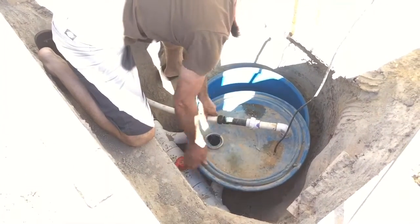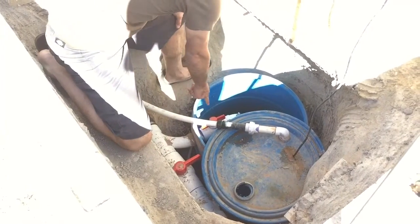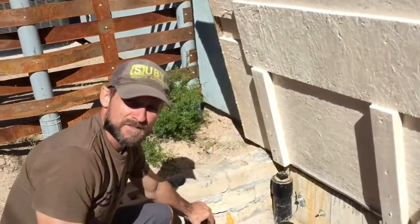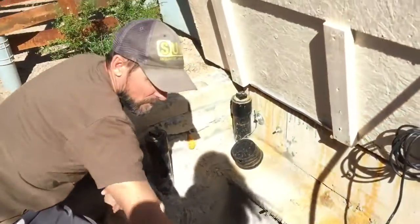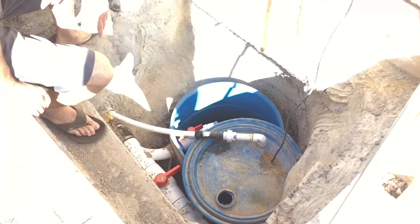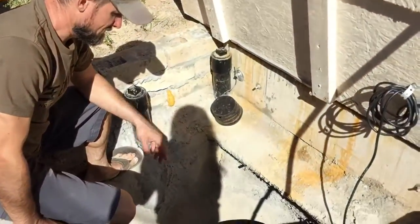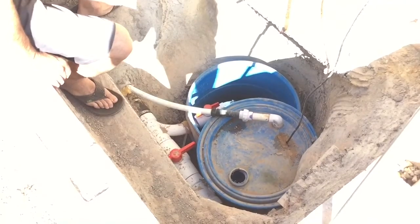Here are a couple of valves — these red valves allow me to turn the system off if we're getting too much water, as in monsoon season when the backyard is getting too wet. I can throw those two valves and that diverts all the gray water into the sewer. This first valve has a basket on the end of it — that's just a filter basket to catch stuff that comes out of the drain, in case something goes down that you don't want getting caught in your pump.